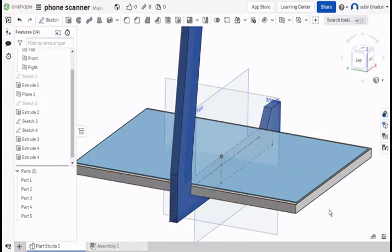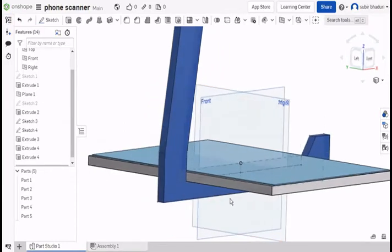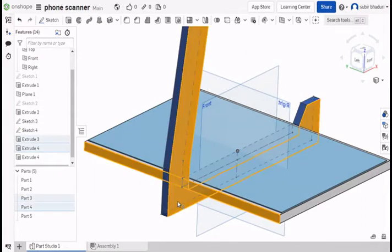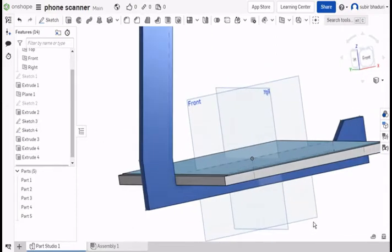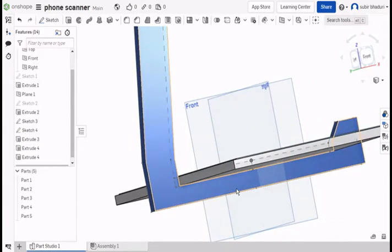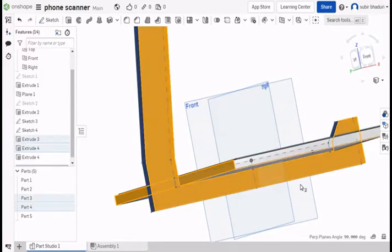Now all I have to do is give a support over here. Now how do I build a support? And first of all, how do I fix this piece onto this piece? A normal trick that we do in laser cutting is to create some notches over here, and some holes on this plywood plate and some notches on this plywood plate, so that they fit in well.